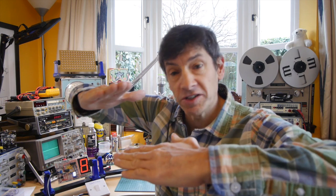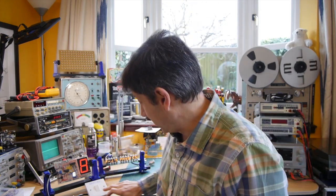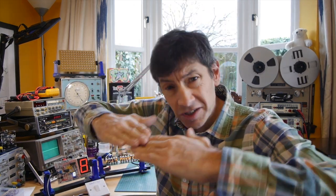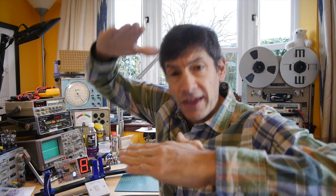If you're not familiar with the effect of switch bounce, let me explain what's happening. The switch contains contacts that contact together, and in the case of a mains light switch, they are pushed together and held together. But that isn't quite what happens when the switch operates. Because it's a mechanical system paired with electricity, as the contacts go together, they don't just contact and stay contacted — they hit each other and they bounce a little bit. That's one of the many reasons for detecting that the contacts have touched more than once before the switch is fully on.